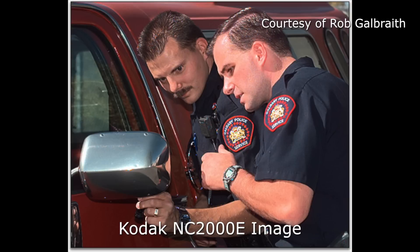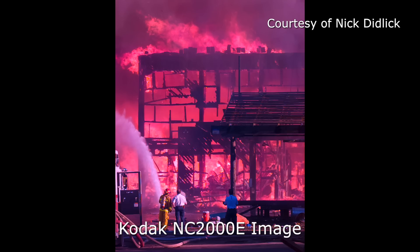As a photojournalist, fast frame rate and good buffer would be essential, but this camera fired along at just two frames per second. Terrible color quality too — particularly if you were shooting under light with a big infrared component, white people in your frames would go a strong purple. If you were shooting fire of any kind, the flames would be a bright theatrical purple. There's no aliasing filter and no IR cut filter on this camera — it's just letting both of those in.